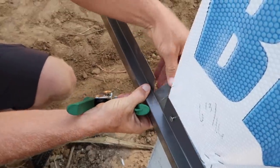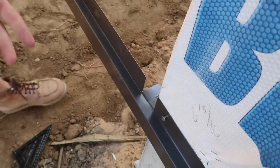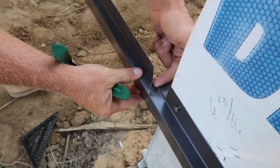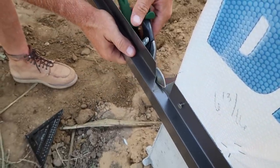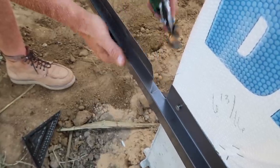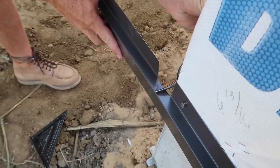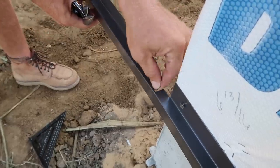It's just easier to bend these over when it's cut - if it's one solid piece sometimes it'll kink in the middle, which we don't want. Now we're going to make a nice 45 right to that point. You can see with the greens it just bent this side up and pushed this side down - that's going to help aid in the bend when I move the trim around. We're going to cut this top off right to that point. Take just a little more material than our line, noticing how it pushed this side up and this side down.